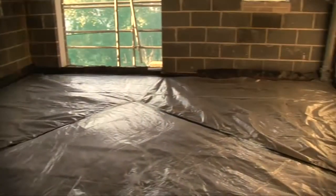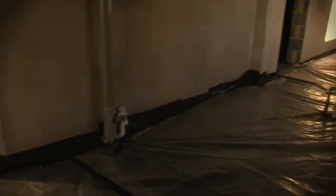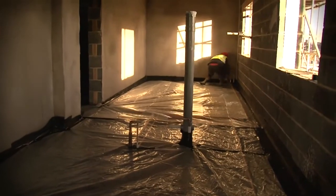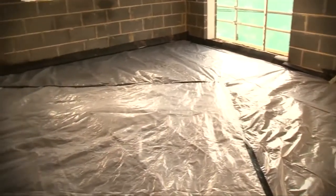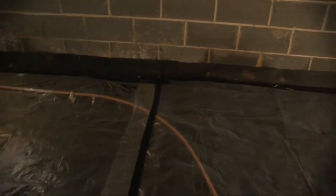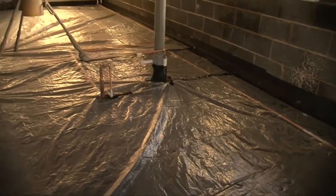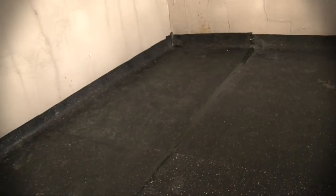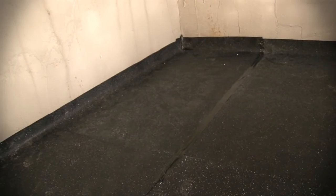If a free-flowing screed is to be used, lay a polythene membrane of at least 500 gauge across the entire floor area, ensuring that any overlapped joints are a minimum of 100mm and securely taped. The polythene must also be taken up at all perimeter edges, and again, all overlapped joints taped. It is very important that the Quietlay is covered in its entirety by the polythene. If a sand and cement screed is to be deployed, then there is no requirement to use a polythene membrane.